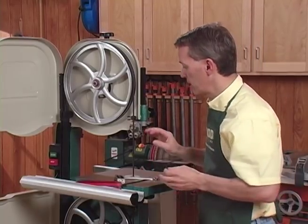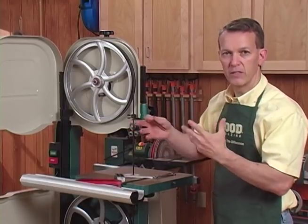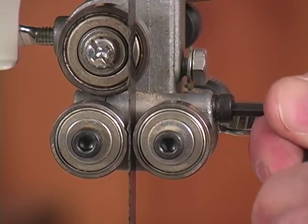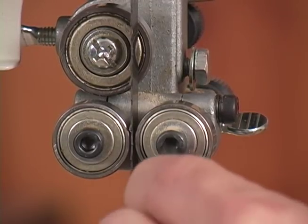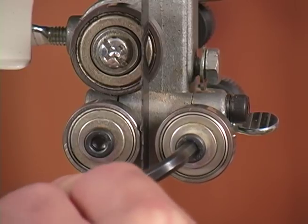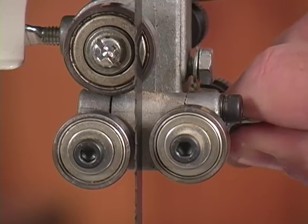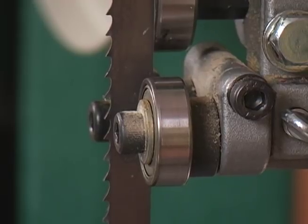The first thing we're going to do before starting the tune-up is to back off these bearings, get them away from the blade, so that as we tune things up, the blade isn't affecting those adjustments we're making. These bearings are held in place by an Allen key. On the front of them, as you turn, you can see it's like a cam — as you turn it, it comes farther or closer from the blade. We're just going to back that out, and back that one out as well. Then I'm going to loosen this thumb screw here. It has a threaded mechanism that allows you to pull the bearings back away from the blade a little bit too.